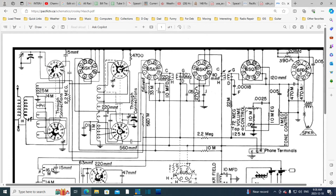Here's the tube we're talking about, the 6F6. Pin one would be right here. You can see there's nothing going on with it at all — they're not showing any connections, just ignoring it like this other one over here. Does that mean this pin was not used for a connection? I don't think this guarantees there's nothing there. In the back of the radio there could still be something. Let's take a look at the radio and find out.